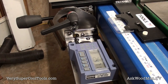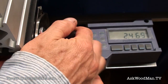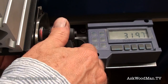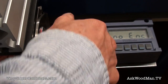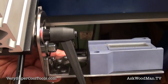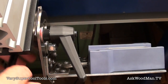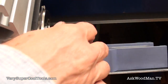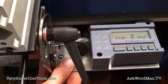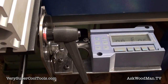Let me show it to you from another angle. So that's in the engage position. I can tip it first if I want, or I can release the connector cord. See, now it says 'no encoder.' I just move this back a little bit, and now I'm completely free and ready to lift the fence off the saw and put it wherever I want. To put it back, I just reach up underneath here. Let me show you another view of that little plastic tab from below so you can see what's going on.